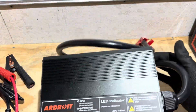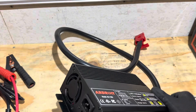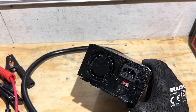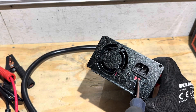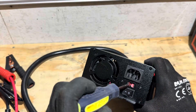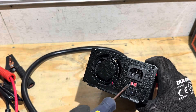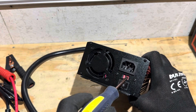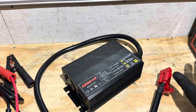One thing of note: the body is very small for a 50-amp rating. It is a switch mode power supply-based charger with microprocessor control, which gives us a wide input voltage range — from 100V AC to 240V AC — with a selectable switch to change between voltages. The acceptable frequency range is 45 to 65 Hz, so if you're using a generator, you have plenty of leeway to work with dirty power and still charge your batteries.